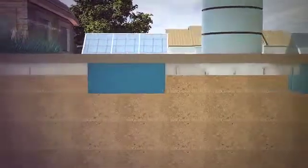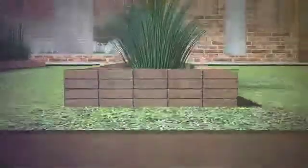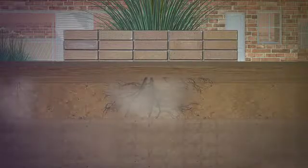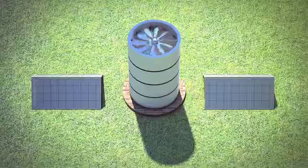That hot, humid air is sent underground via pipes where it then condenses because underground is cooler. Condensed water vapor underground then percolates and naturally flows out into the surrounding soil for use by the plant roots. And that air is being drawn underground using a solar chimney or a wind-powered ventilation fan, again using renewable energy sources.